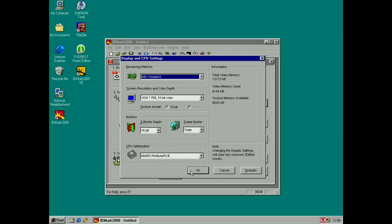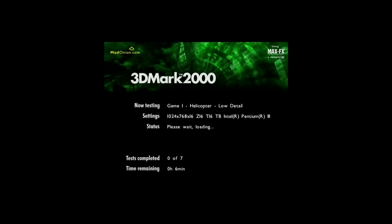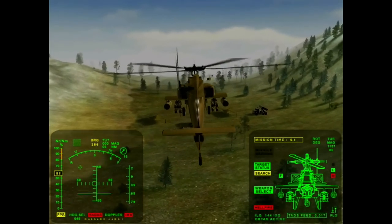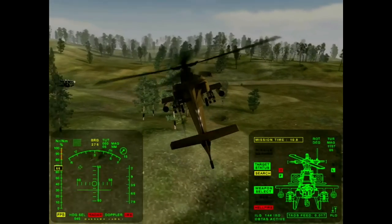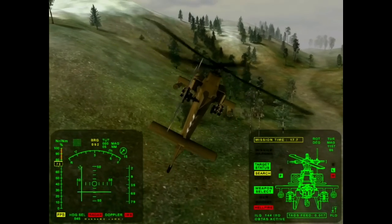So that seems fine. The Pentium 3 is running at 933 MHz. Can remove these, because they test features, but they don't test performance. So gonna benchmark this, and I'll find out what the score is, and then I can look for my other card in the meantime. My other PCI card with the 3000, and I think that's the normal SDR version, and then we can bench that too, because this looks artifact free. So hopefully this passes here.